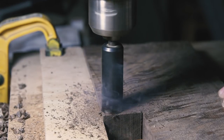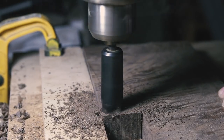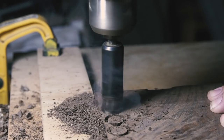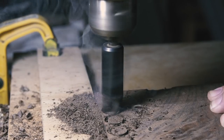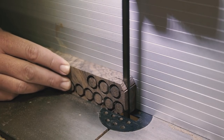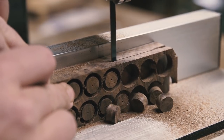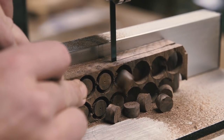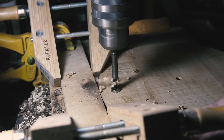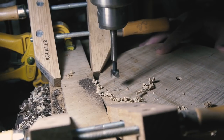I used my obviously dull half-inch plug cutter to cut some plugs out of walnut. Then I headed to my big bandsaw with a 3TPI blade installed, which is clearly too aggressive, so I headed to my small bandsaw with a much less aggressive blade. Back at the drill press, I bored out some half-inch mortises to be filled by the plugs. I used some hand screw clamps on my makeshift fence to make a simple jig for accuracy.